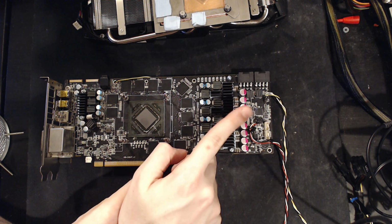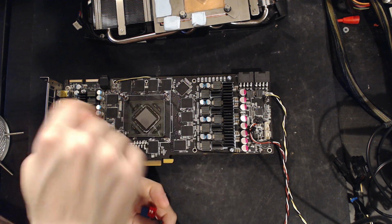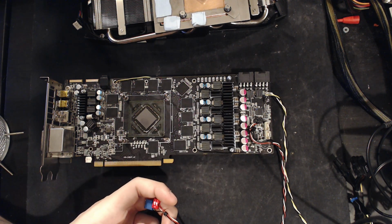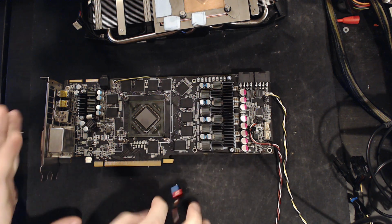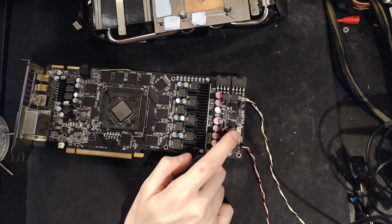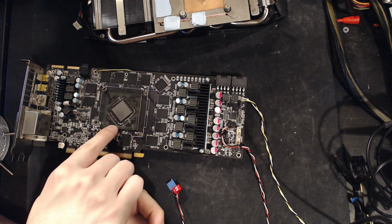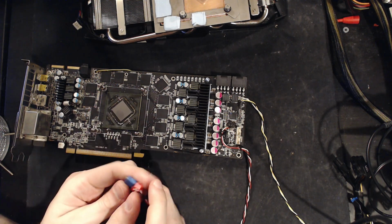Similarly, if you measure the memory sense pin to ground, most of that resistance you're going to measure is going to be the memory's own resistance. So yeah, pretty annoying, and you basically have to lift off the entire positive side of the input and then rewire it. So red wire goes to Vcore, and it actually goes to Vcore where Vcore originally came through on its own. One of the resistors I lifted off connected the chip to the trace that goes to the back of the GPU core. So basically the ending of that trace is the red wire. So I'm still using that old sense line, so it's actually measuring the voltage from the same place as always.